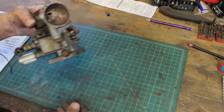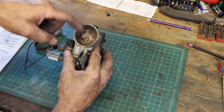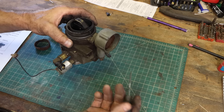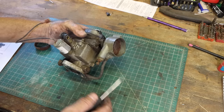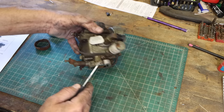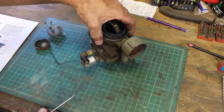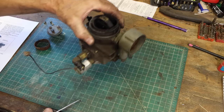All right, here's our carburetor. So this was the choke, and I can see down in there, it hits a stop. Yeah, that's the pull-off adjustment down here that, of course, I was coming at this from the top. And you can't see anything, and the valve cover's right there, so there's no way I could get to that. So that's part of why I took the carb off. There's another adjustment here, and another adjustment there. And of course, they're all nearly inaccessible the way you have access to this thing. Now that I've had a look at them, though, it'll be easier.